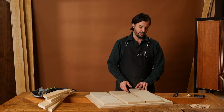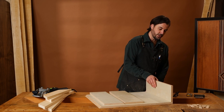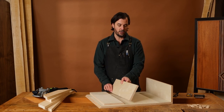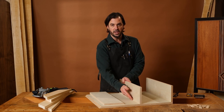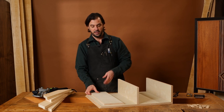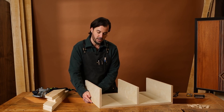First thing first, I'm going to show you a few different setups with this plywood. First, we're gonna assemble the Domino butt joint with the side of the panel. Second, we are going to assemble this piece in the middle of the panel, and I'm gonna show you a trick to align it with any kind of line you want to go with. Third, I'm gonna show you a 45 degree angle assembly with the Domino so we can have a well-aligned and solid wood joint on this panel.